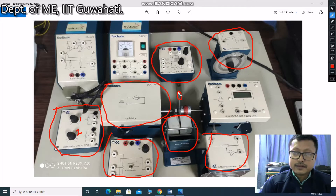This is a magnetic disc. This is the DC motor and this is the motor shaft. That motor shaft is connected to one disc — a metallic aluminum disc — and there is one coupling. That coupling shaft is connected to this reduction gear tachogenerator unit, which is a tachogenerator. The tachogenerator is connected with the output potentiometer through this shaft.